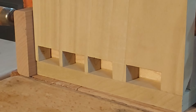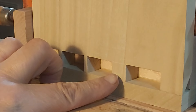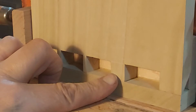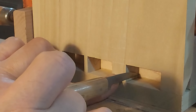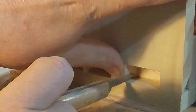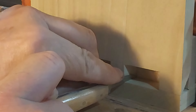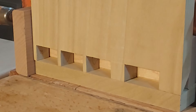To trace the pins to the side or tailboard, you can come in with a pencil and that would be your line. Or, what I've been doing most recently is come in with a knife — I put it up against the pin, pushing in this direction, up against that stop, and I don't drag the knife; I just push the knife down. That is what I have found to be the most accurate line. I'll do that on all of these and then show the results.